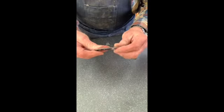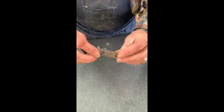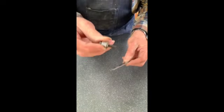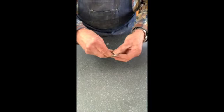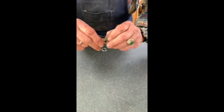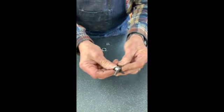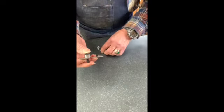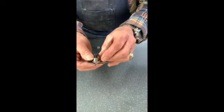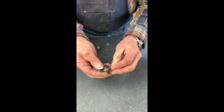So I'm going to rebuild these, 4 of them, and it includes, when it's mounted, it's bolted in with just this 1/4 inch bolt. But this bushing is placed inside the sander to act as essentially an axle bolt. So the bolt comes from the outside of the drum sander to the inside, and this rotates on it. And then this larger shoulder is what accommodates that spring. That spring goes in there like that.